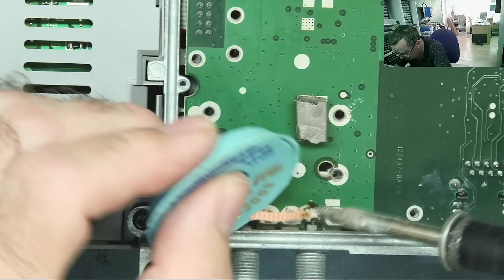I would look for these by searching for SMD code L8 and then SOT23, which is this package. Another one here, 1FW, but just looking at this now, these two points are connected together. That probably is a resistor. It looks a bit more of a grey colour now. So here, and that comes from the output of here. So it looks like this and those may be connected together.